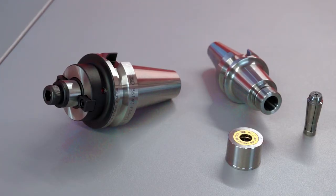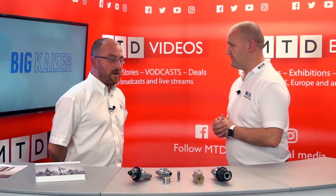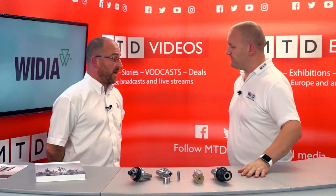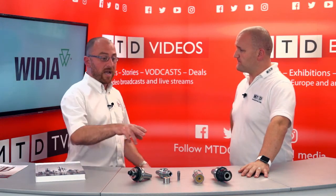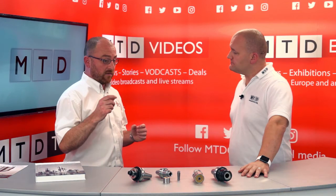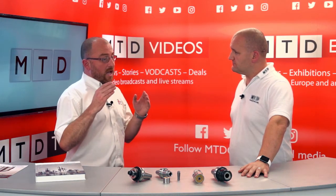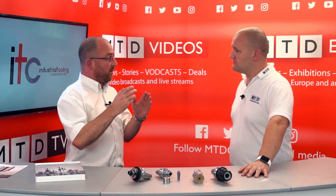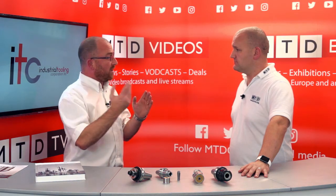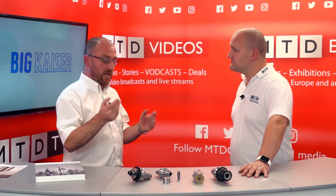So what would you say to the people who invest tens, if not hundreds of thousands of pounds on a machine tool, and they go and put cheap tool holders in? Okay, well, everything's made to a tolerance. Us as engineers understand that. As I've said, the tooling that we have here, 4 times diameter, 3 micron run out, guaranteed. However, even on more cost-effective tooling, say a side lock holder, you're doing nothing but asking for a run out. There's bolts on one side of the tool, etc.